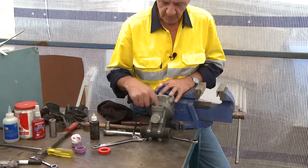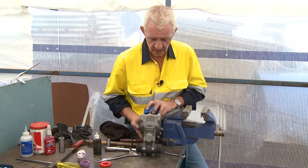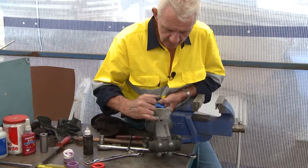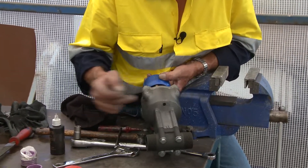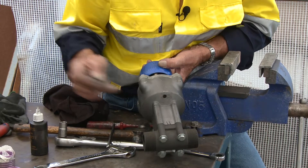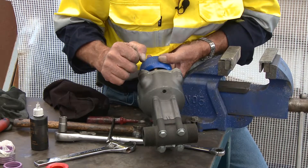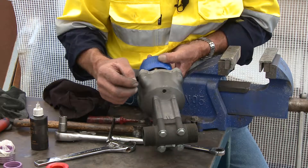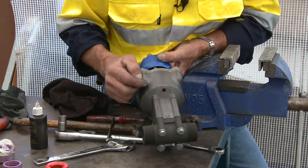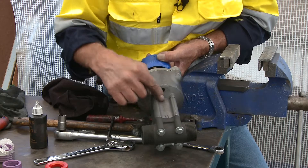The other reason we may have to pull this Thompson valve to pieces is if we have excessive moisture coming through the pusher line. On the back of this particular valve, this is where the air comes in from the auto air valve — it's fed in here through a tiny eighth fitting. The air comes into this and pushes the piston open to lift it off the seat and allow the garnet to fall through. If you have a lot of moisture in your air, that can have a detrimental effect on the operational aspect of this piston. And if you've got dust within your grit — if your garnet's been reused — you expose this to fine particles of grit coupled with moisture, which can accumulate inside this piston and cause it to jam or stick, and also affect the main piston functionality as well.